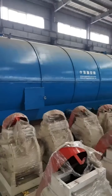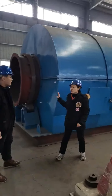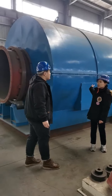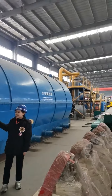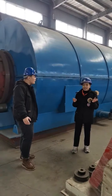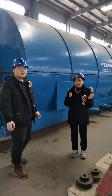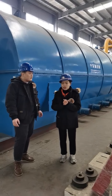It's the main part of the whole system. Inside, with tire and plastics, will be pyrolyzed into oil gas at a certain temperature. And the oil gas will go through the cooling system. After cooling down, it will convert into fuel oil. This fuel oil will be stored in the oil tanks. And after watching our processing video, you know there will be a small part of uncondensable gas.